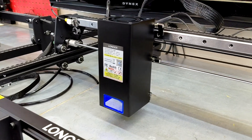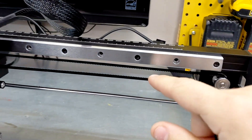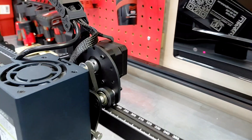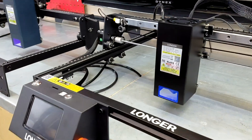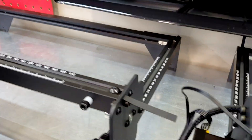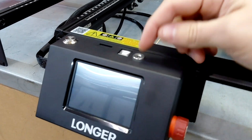If you look over here, I can kind of rotate those on that side rail — so that's been improved. They've also moved the motor over here. The motor is on the right side of the chassis now, with this belt that runs top and bottom to the laser assembly. Over here we have the motor on that top center location. A couple of little changes, as well as the limit switch — it's mounted here on the side instead. On the other, they have it on the bottom. They've also increased the size of the frame just a little bit to accommodate the larger laser head.